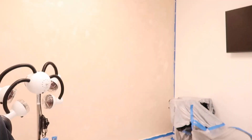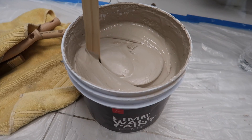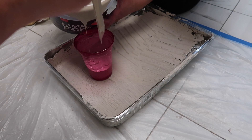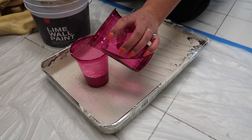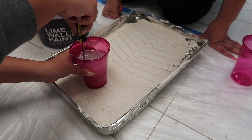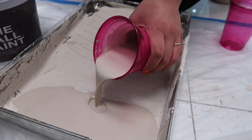Here we are. The paint does look a whole lot lighter than it did when it was wet. All those wet brush strokes that we were able to see yesterday have pretty much disappeared and it's a lot more flat and cohesive. There still is a little bit of dimension, but definitely the color and texture does look a lot more solid. So now we are going to add even more depth to this look with a second coat. We opened up our paint again and gave this a super good mix because it is super thick. For this coat, we're going to do 50% water and 50% paint — equal parts — poured together and mixed. We did end up doing this process about three times from beginning to end of the wall, so if you have a bigger cup or bowl to work with, that might make it a little bit easier. Once that's nice and mixed, you can already tell the consistency is just so different — a lot more watery.